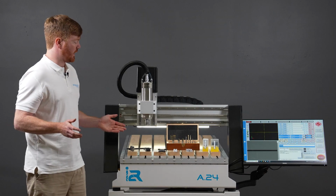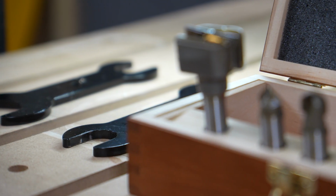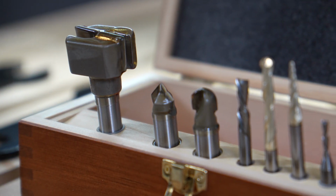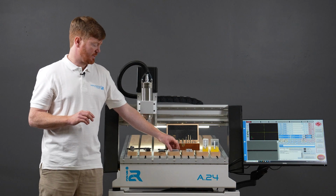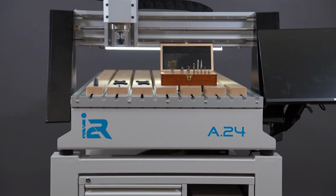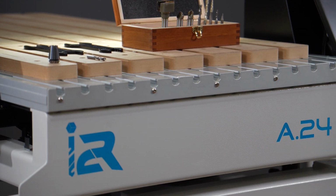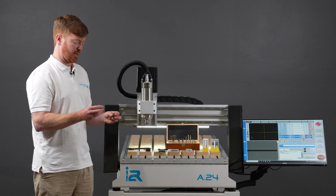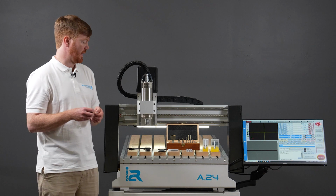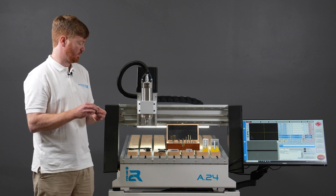The last topic we'd like to discuss in regards to CNC tooling and collets is maintenance and the fact that they are consumables and they do need to be replaced. With your CNC tooling, as the blades of your CNC tools dull, you will start to notice degraded cutting on all your material, and that's a sure sign that you need to replace your tooling. The collets themselves are consumables also and do need to be replaced after 300, 400, 500 hours of machining. And it really depends as well on how often you change that tool.